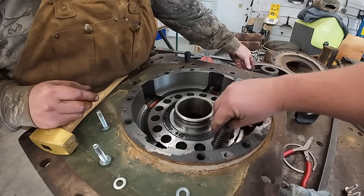If you come over here on this big chunk of metal, we've got two part numbers on here too. We've got the later part number right here. But the earlier part number — which is what this is — is right here with the dot and a JD next to it. So that is an earlier final drive outer, which is not compatible with that newer inner part. The seal changed. So I priced out that part by the part number — it's $4,700. After we found out that's not the right part, I priced the other part out. How much was it? $10,000 for the new style outer. That kind of threw a monkey wrench in things real quick.